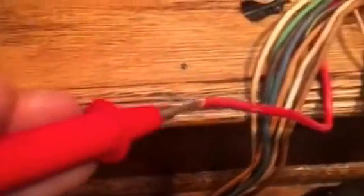Pin 57 powers up all the sensors and pretty much everything, so that circuit runs through the whole harness. If I touch this wire — maybe you'll hear it — I get a signal, so I know I have a connection all the way back to the other end of the harness.